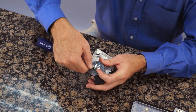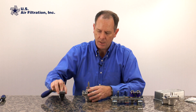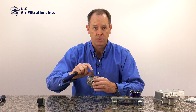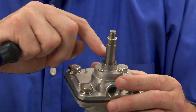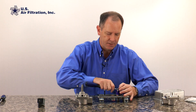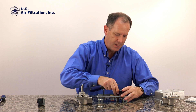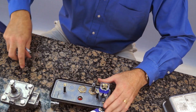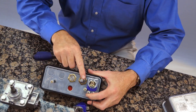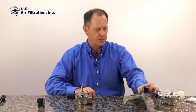There's a little clip on the top and I just lift it with a screwdriver and it slides right off, and I can pull the coil off which exposes the solenoid post — this is the part that we're going to be replacing today. If you have one in a box it looks very similar. I'll pull the clip off, the coil comes off, and again the solenoid post is exposed. Whether you're doing it on here or here, the process would be very much the same.